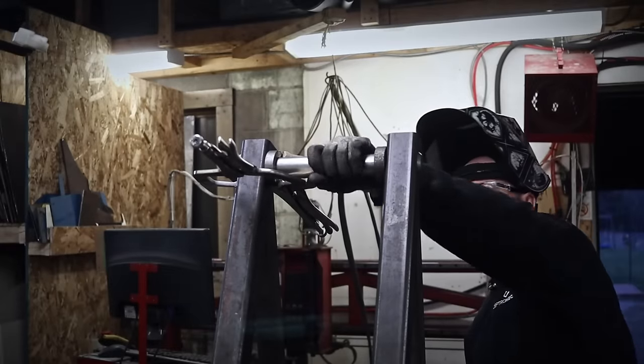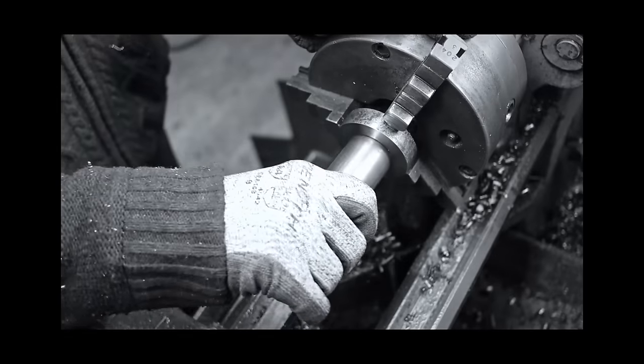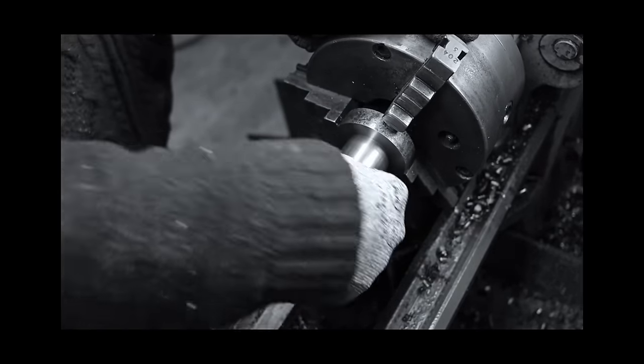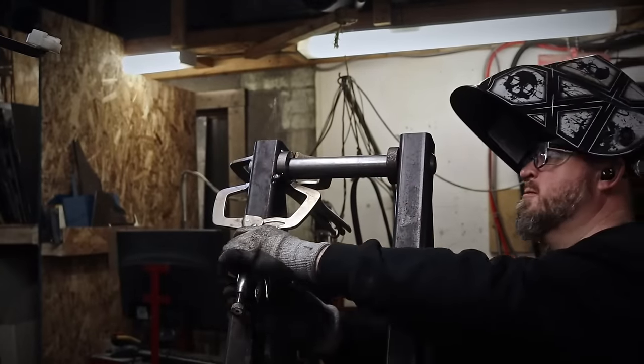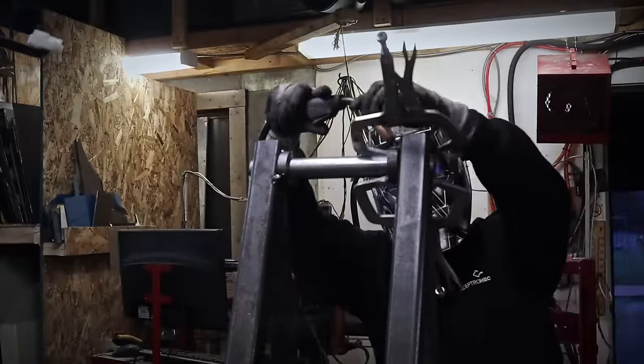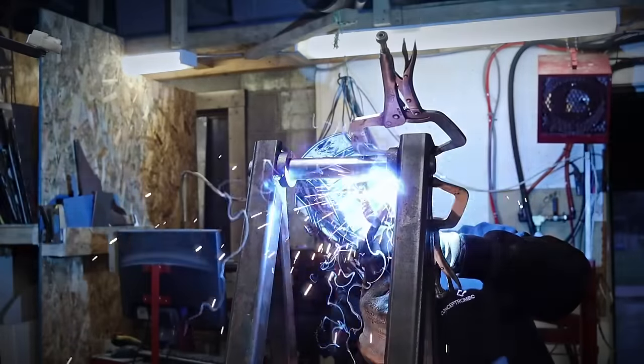Remember when I said the bushings were a bit too tight? You know, like 4 minutes ago? Nah. Gonna give me a bit more room than that. That's too tight. Yeah, once welded in place, the bushings will move around and it's gonna reduce the fit with the shaft. So always have that on your mind.